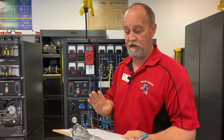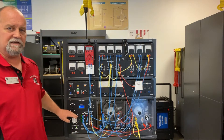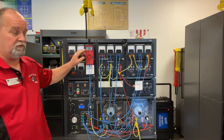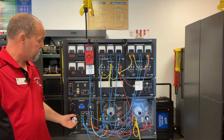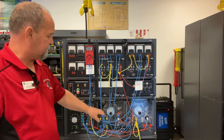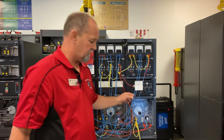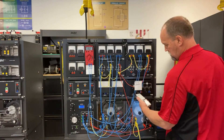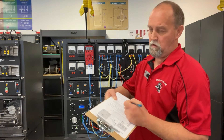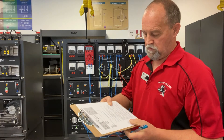So what it's telling us next on line 11 is to increase the excitation voltage to get a reading of 80 volts. Once we do that we're going to check our field current again. So now that I'm reading 80 volts being output from our DC generator, we're going to read and see what the current is. And I'm reading 0.170, or 170 milliamps.